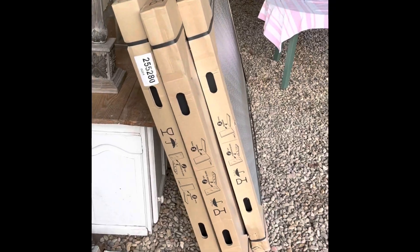I'm quite excited — we're hoping to have a form of ecological heating. The idea is that I will be connecting the hydro up to the immersion side of the tank. We're going to have two immersion heaters of three kilowatts each, and I'm optimistically hoping to get six kilowatts out of the mill once it's up and going. That's a little more complex at the minute, but I'll get back to you when I've done something else at the mill.